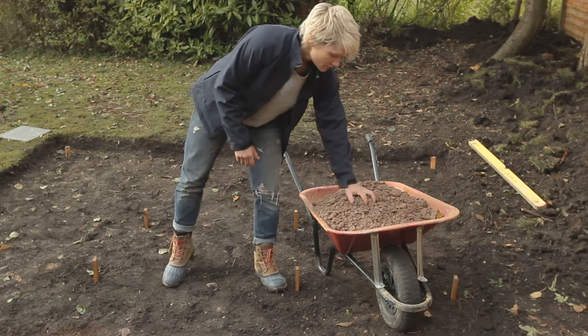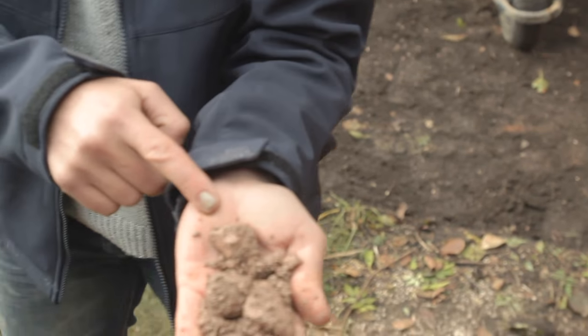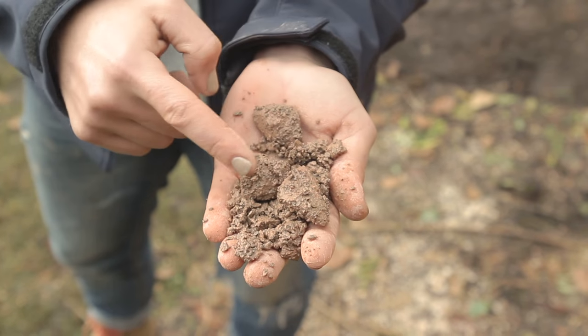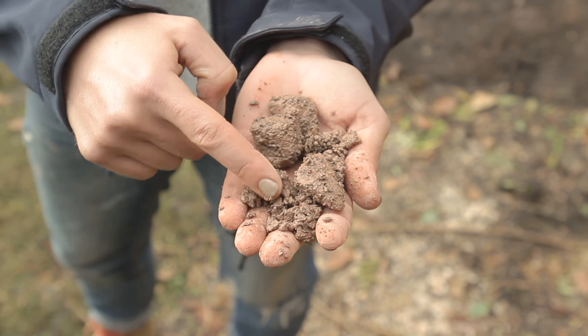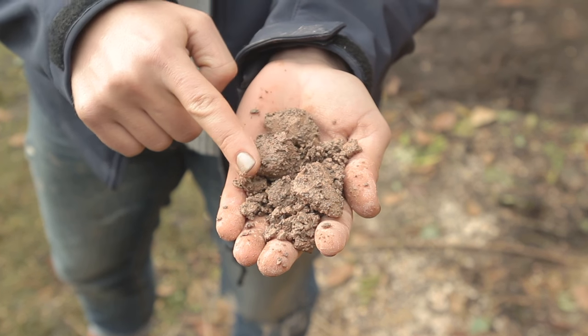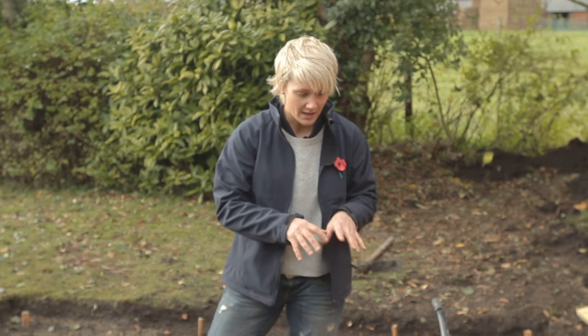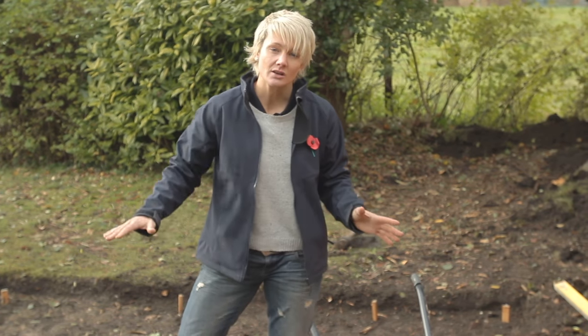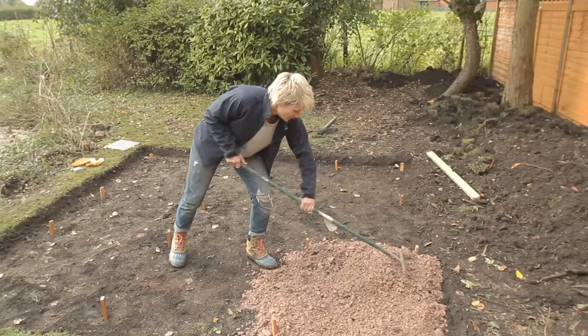This is scalping. As you can see, it's full of big stones, small stones, and grit — quite slimy in texture. It's basically old crushed road and stone, and that's what we're putting down as our base layer. Because it's so compactable, it gives us a nice solid foundation. We don't want to skimp on this.